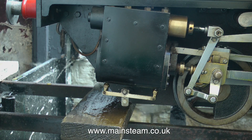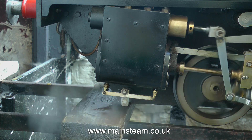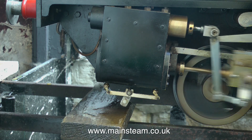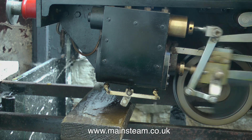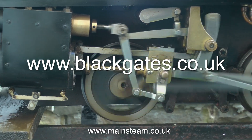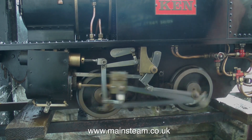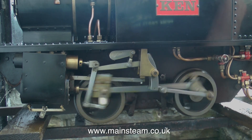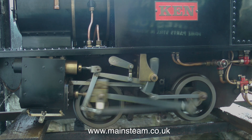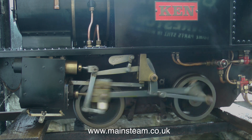It is based on the Kenyan Brothers seven and a quarter inch gauge modification of the LBSC Titch engine, but it's very different. The cylinders are Sweet Pea cylinders — cast iron Sweet Pea cylinders obtainable from Black Gates Engineering, the web address is on screen. The valve rods are made from 316 stainless steel, and I found some ball races which were quarter of an inch outside diameter and one eighth internal diameter. On most of the moving parts there's actually a ball race — not on the main coupling rods and not on the connecting rod, but just about everywhere else — and it's really worn very well indeed over the years.